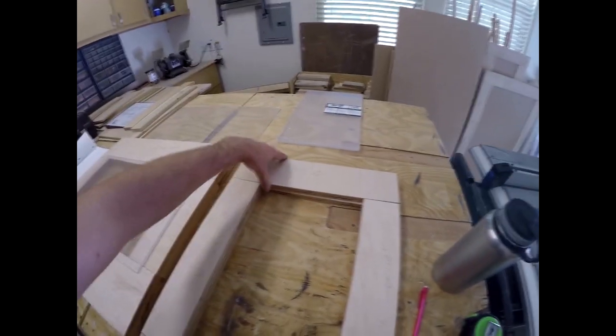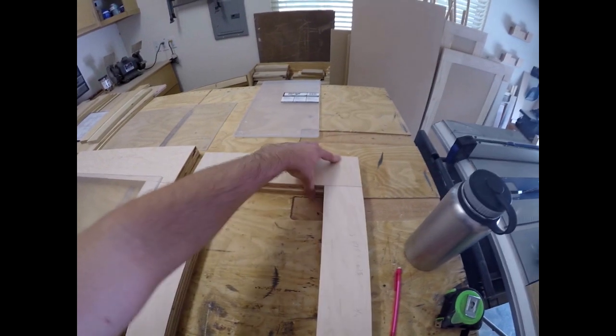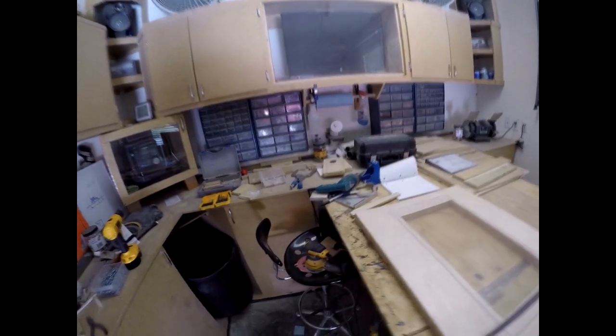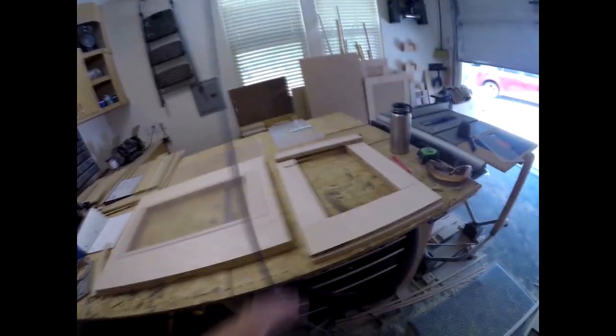I'm going to put the camera down and just get going. For the assembly, you could either just pocket hole these together, which I think I'm going to do. If you want an added bonus, you could add a biscuit, which is this little puppy here - that would just go in between. I already have all my stuff set up from my previous project, so I'll just biscuit the joints with my biscuit joiner, which is already set to three-quarters. Then pocket hole, and once the frames are built, I'll sand them and shoot them with a clear coat.